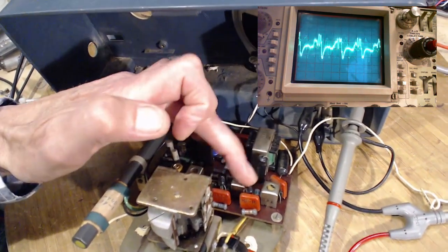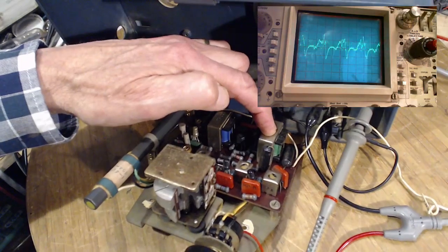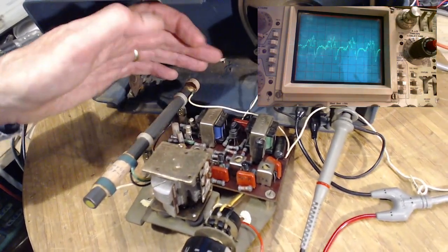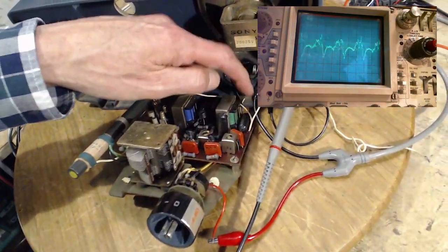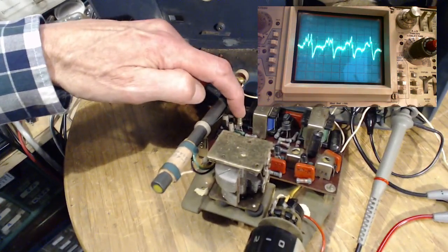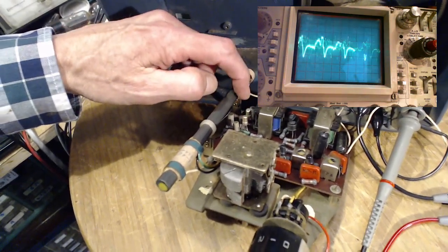These are no doubt radio because they're involved with these here. This is part of the radio side of things. Audio. So one of these is going to be driving the speaker and one of these is going to be driving the output transistors. So, just using stupid analytical techniques, these wires from the speaker go over here, probably related to this. So probably the signal path is, these are probably the two transistors. One of these two transistors is probably the one we're after.